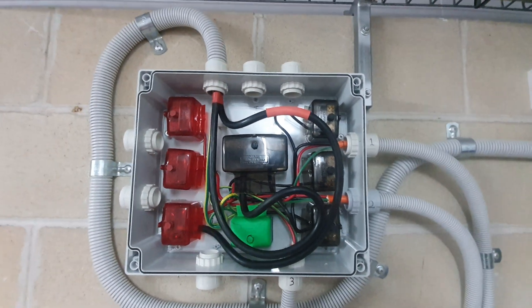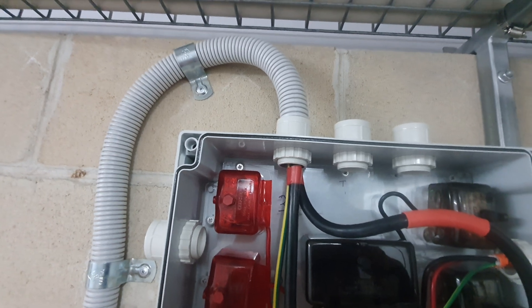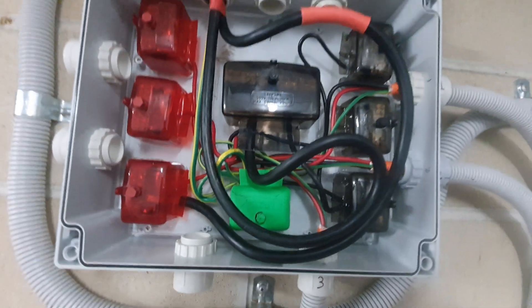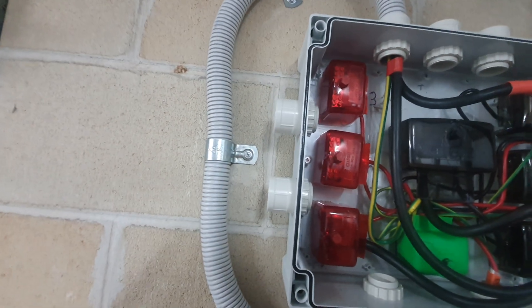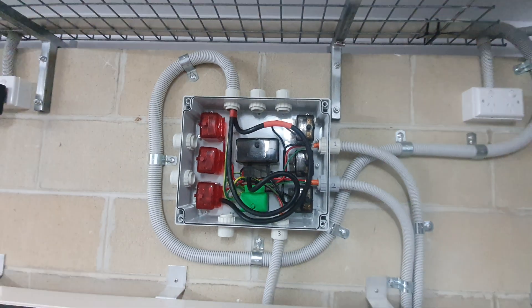There's another neutral link between each one. As you can see, I'm only using one input at the moment, so it's only single phase with an active and a neutral. I've left enough room to put another two cables in the side if I need them. I'll plug them up — it'll have a lid and couple into it.